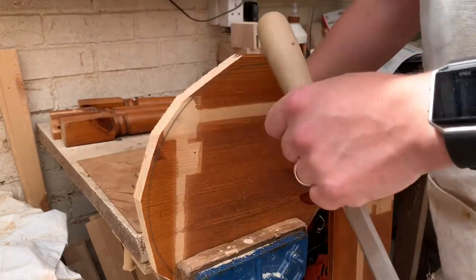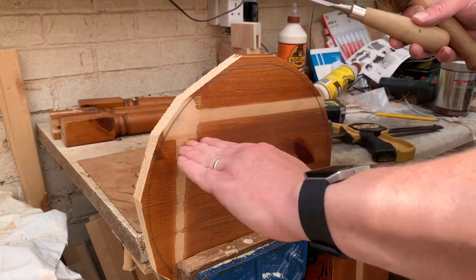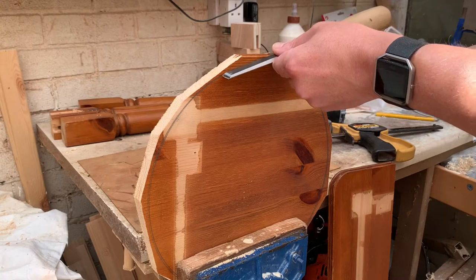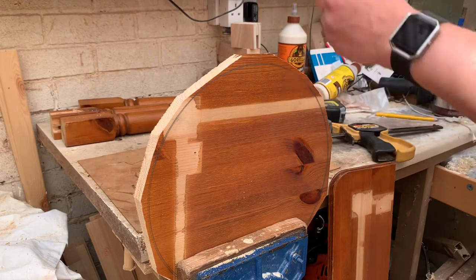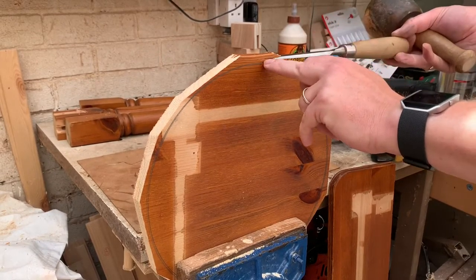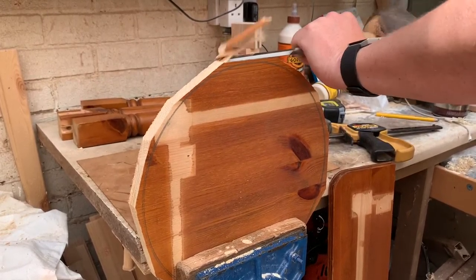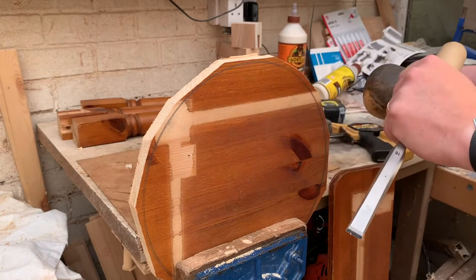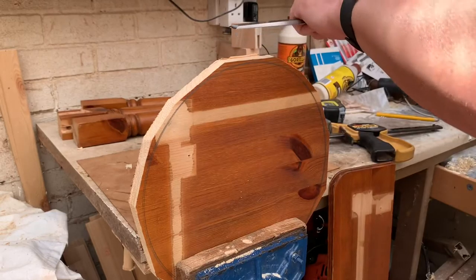Now that we've roughed out that shape I'm going to smooth it off with the chisel to get closer to the line as we go around. Still thinking about the grain of the wood here — if you think back to the carving videos we did earlier, I'll put a link in the description for those. Making sure we always chisel downhill in relation to the grain. I don't want to come up this way because it will split those sections off. So we're going to go from this point down and keep turning around, turning the piece upside down and working our way all the way around.